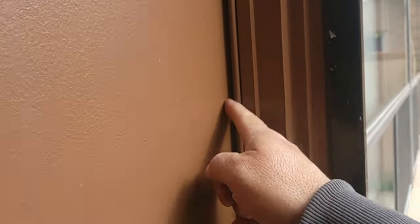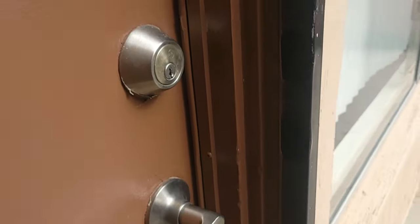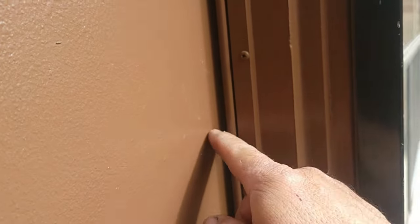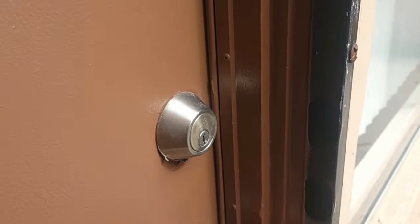This is what you regularly see - that's weather stripping that's on doors. As you can see, it's got some weather stripping here. There are two ways of fixing this. A lot of people will go and put foam behind all that weather stripping and build it up with foam. That's one way of doing it, but that's not the way I do it. The weather stripping in this case is still good - not torn up, nothing wrong with it.